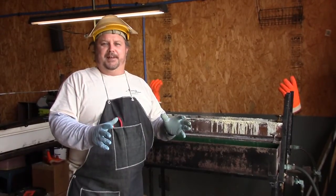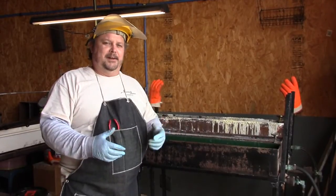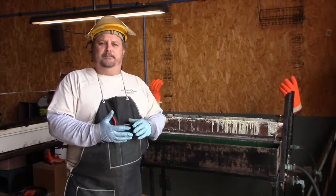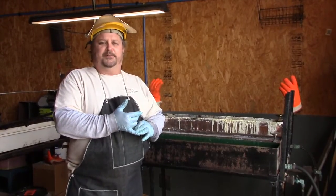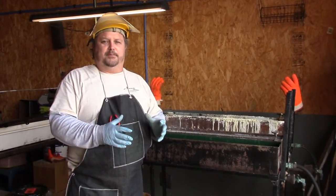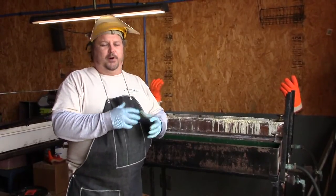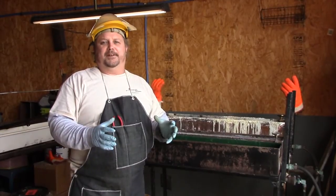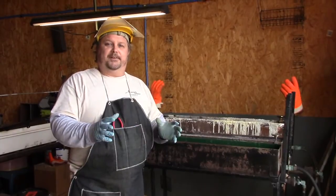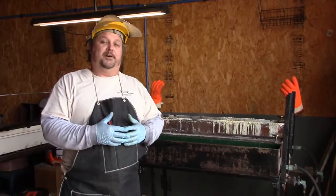In this process today I'm going to talk a little bit about our bluing process and how we go about doing that. We offer four different types of finishes in our bluing. We do a basic finish in which we wire brush the metal and blue it. We do a textured tactical black in which we actually blast the metal to give it a parkerized look. We also do a satin black finish in which I use a different media to give it a non-glare satin finish, and then of course we do your high polish finishes all the way up to an 800 grit.